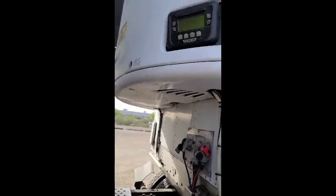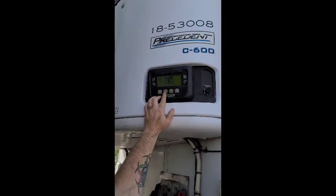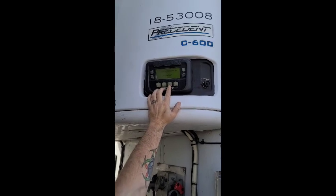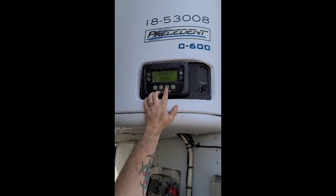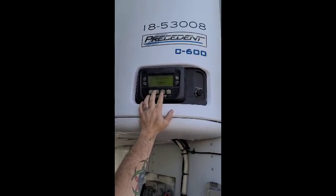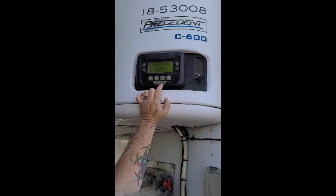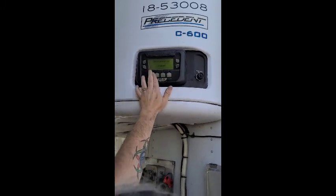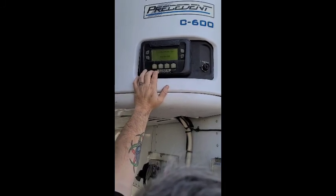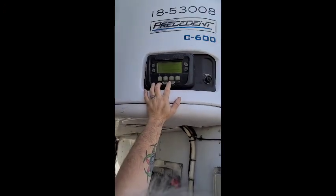All right, for some reason the other video cut off, but I'm gonna show you guys how to prime the unit. All right, basically what you do is you cut it on. Wait for it to come up till you get control of it. Basically, you're just getting back to the main menu before it cranks, or in this case, tries to crank. But you're gonna be using your soft keys right here. It's super simple. And you want to do this before it cranks.